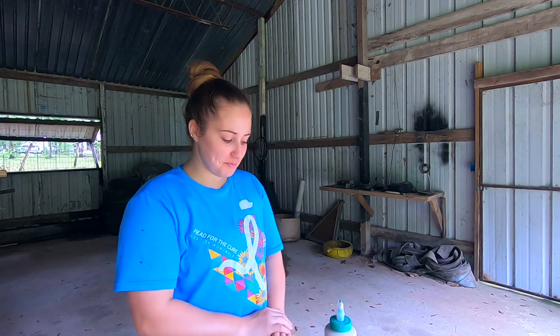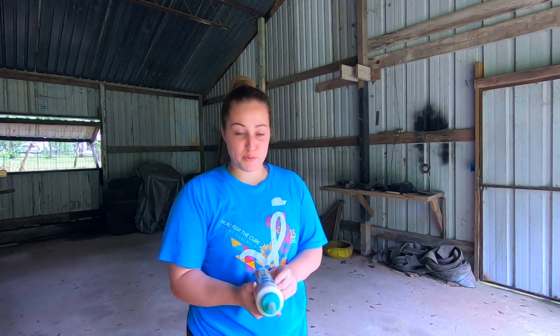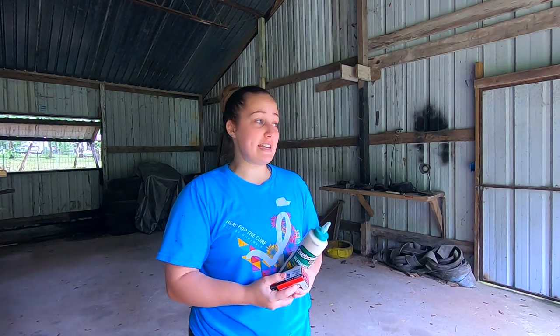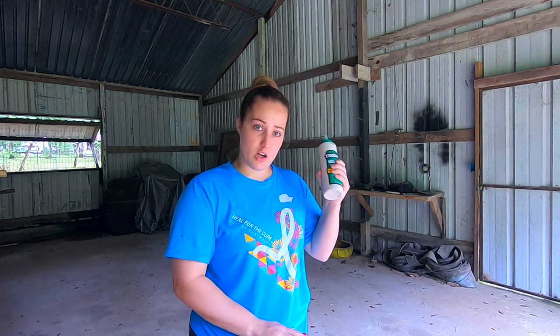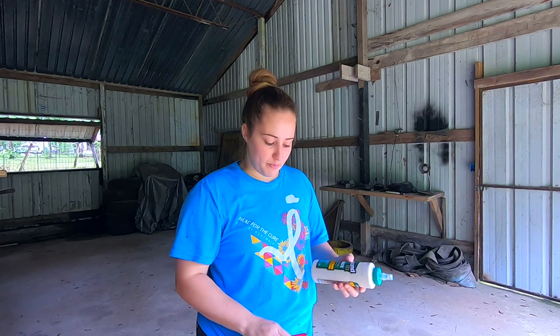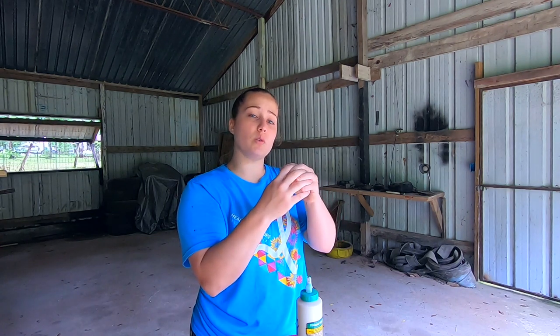Going to start actually installing those tongue and groove panels, which is really exciting. What our method is going to be, or what we're going to start with trying, is we're going to use some wood glue and some finishing nails. We have a nail gun, so we're hoping that the combination of this wood glue being really strong and putting some of this on every single finishing board, letting it sit for a while and really dry and get that good bond, and then a couple of finishing nails on each one, as well as the tongue and groove sticking together and holding each other up.